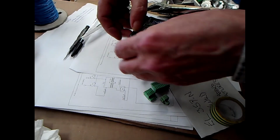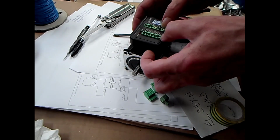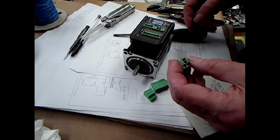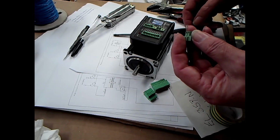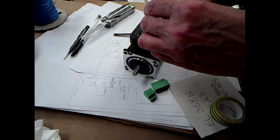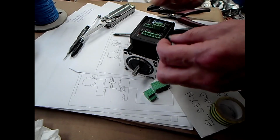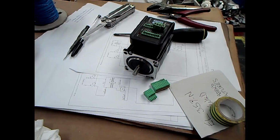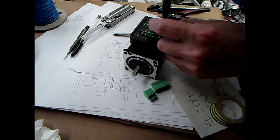The fix was not to clear all RAM and do a fresh start each time. If the known values in RAM are true, then it can be assumed the other values are still intact. So each RAM location is read and rewritten, restoring its flip-flop levels to their proper voltage, and then resuming with the main program, resulting in a recovery from the power glitch.